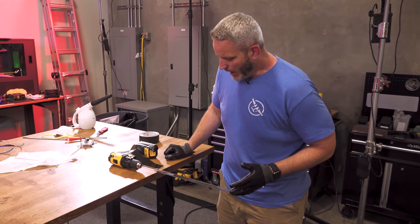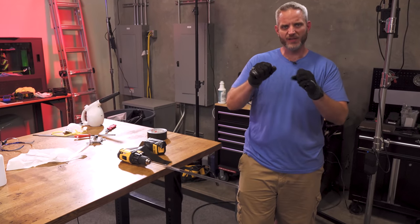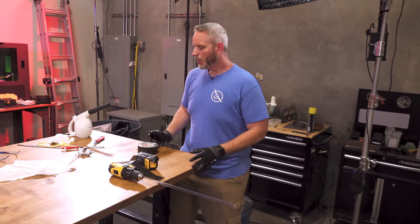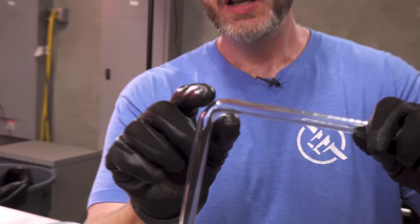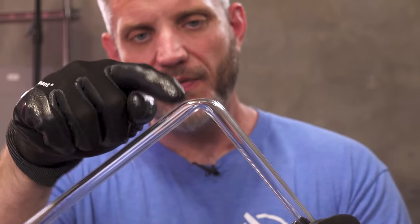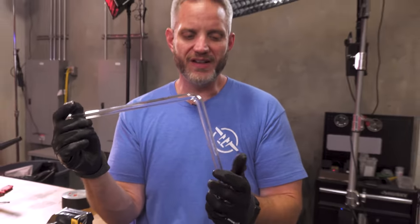It's not a long enough piece for me to blow into, because when you blow into glass that keeps it from collapsing on itself. So what I did was I just heated up the glass real, real hot in one spot so the weight would make it bend on itself. But the problem is, as you can see, it flattens out on the outside and it crimps the inside. Sure, you'd still get water flow through there and it'd be perfectly fine — it's just aesthetically not pleasing. So that's why I want to see if I heat up a wider area, will we be able to get it to bend with more of a smooth radius?